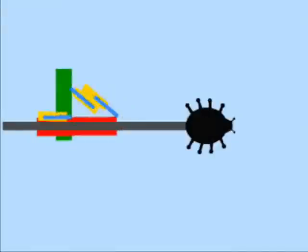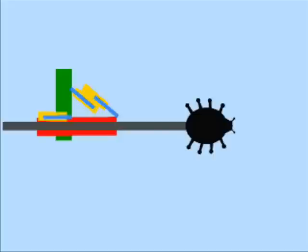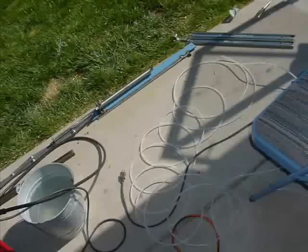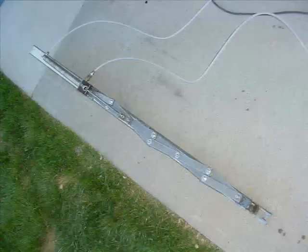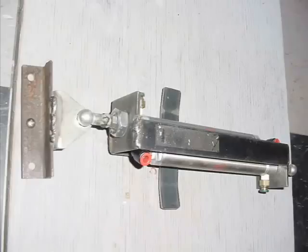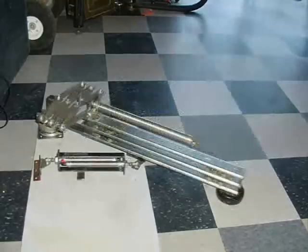Moving on to the drive system, I came up with a concept to move the unit back and forth and in and out. The setup uses three pneumatic cylinders — one for in and out, and two opposing so I can have a center position and side to side. Here you see a scissor mechanism that I created to give me my forward lunge. Using an old caster as a pivot, I started on my side to side, and here you see a little animation clip of the mechanism working without actual air hooked to it. It came out pretty nice.